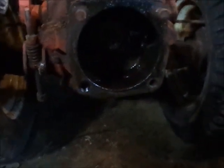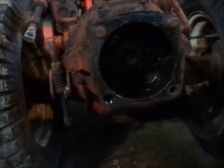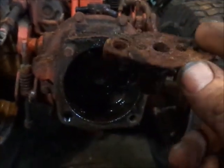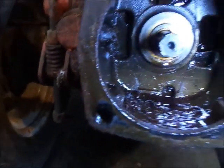The only other thing I see down in here is this bolt. And I think that was the bolt for the shipper shaft. And I think that's part of the body still in there. Yeah, it is. I got my camera hand oily now. Alright, let's see here. Can we do this? There we go. So that's weird. They left the shipper shaft body and the dog gear and put the plate back on. But they took the shipper shaft and the trunnion block. Making sure, looking around, I would say so. That's what I see going on in there.